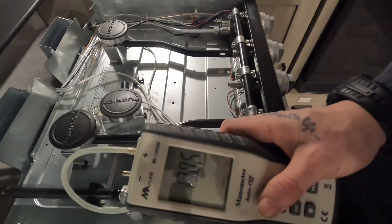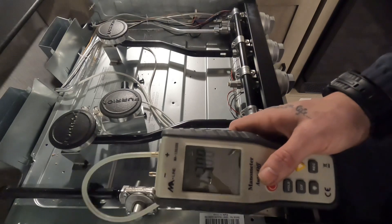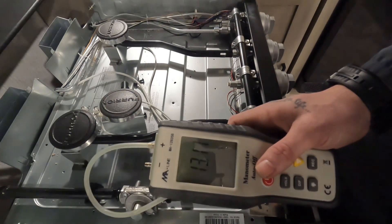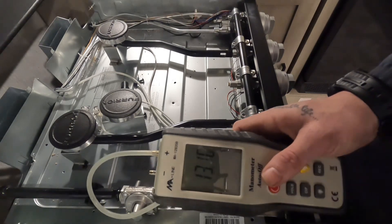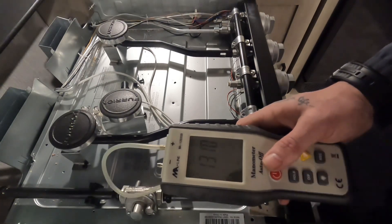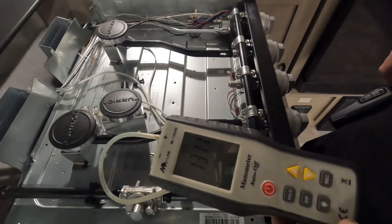We're going to read 13.05 — we'll call it 13 inches of water column. You don't want it to be anything above 14.3. This is your first test: a lockup test. This is showing that the regulator is locking up at about 13.1 inches of water column, which is great. You don't want more than 14.3 — that is too much propane for the system and you have a regulator issue. You also don't want it significantly low; if this only reads five, you either don't have any propane, it's not on, or you have a bad regulator. So we've done our first test — a lockup test — and verified that the regulator is good.